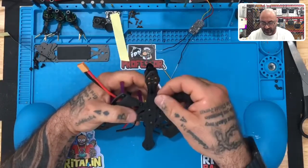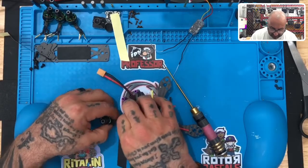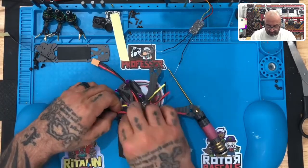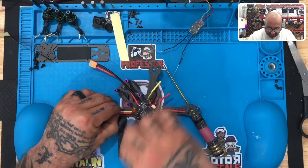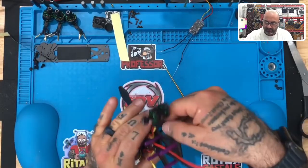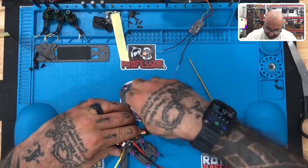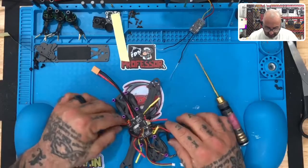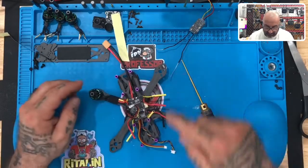Start the tape on the bottom, right in the middle, then turn it over and make sure the pyramid of wires is lined up. Yellow and black go on the bottom, then place the red like a pyramid right in the center of both on top. Make them stack a little bit, then take your tape and pass it right over and wrap them to make sure they hold. Now you have your yellow and black on the bottom and your red in the center. We're going to repeat this process for the next four motors.